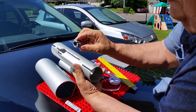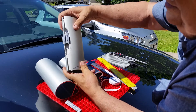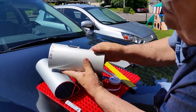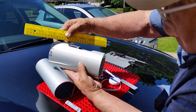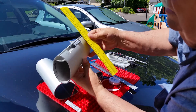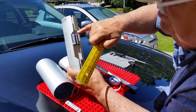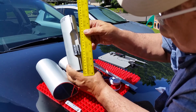Here's another type — working on a prototype, you may get a sharp piece like this to install. I need you to photograph it slid to where it just stops, and I need a photograph from the side using a ruler, and from both sides, and dead on. This will give me an idea of what compensations I need to make to help this better match your cutout. Then slide the other direction to where it just stops and do the same thing — photograph from dead on, side, and other side.